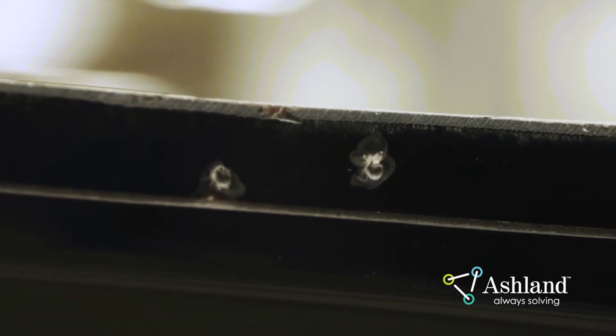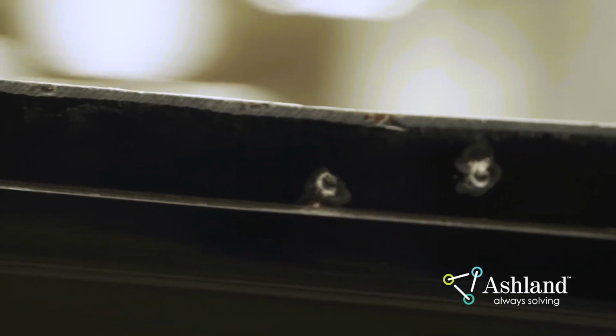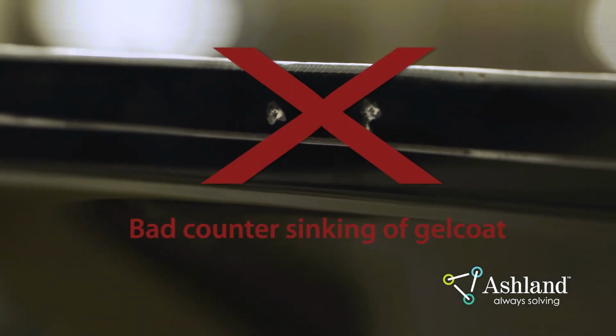The most common place to put a scribe line is on the deck and hull between the area where the two will be screwed together. The scribe is then covered up by a rub rail. The disruption in the gel surface will help keep the crack from extending past the cut line onto the main surface of the deck or hull.